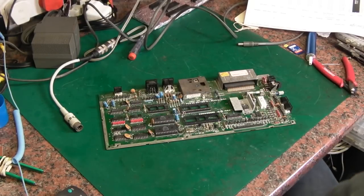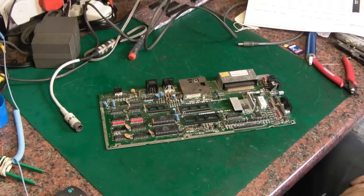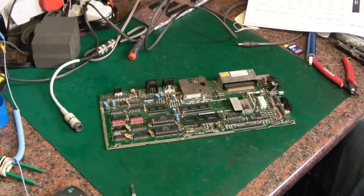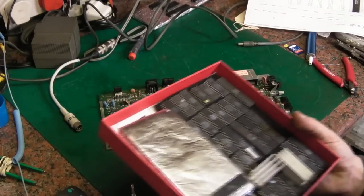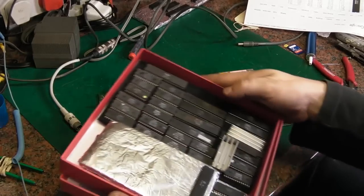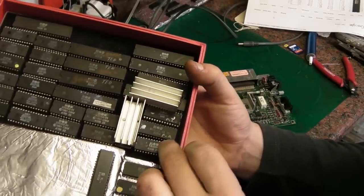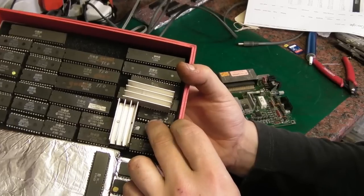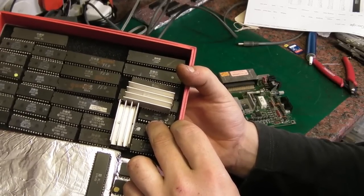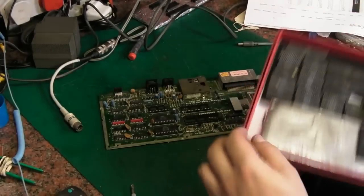And fortunately I do have one, being that I've got a Commodore Plus4 and that uses exactly the same part. I've actually even got a spare, I've got one in my box here. I actually realised at first it was for a C16. I thought it was a C64 one, but it's that one there. It's 251641. That's the PLA for the C16 and Plus4.